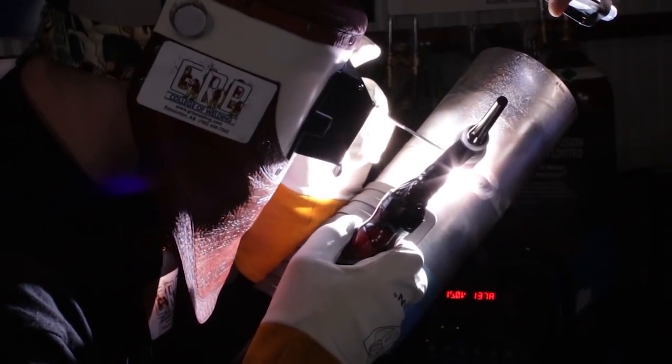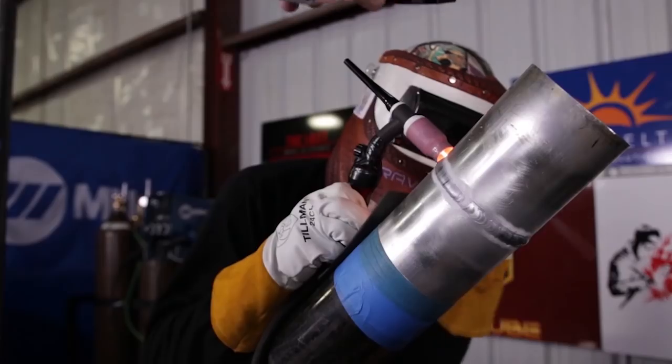Number 3 on the list is adding filler metal to the hottest point of the puddle. With the filler metal being fed externally on the outside of the pipe, the root pass is going in via capillary action. Where you add filler metal depends on the influence gravity will have. Normally on a 2G horizontal and 6G 45-degree angle weld, you add filler metal to the uppermost portion of the puddle so gravity pulls the deposited metal downwards. For a 5G position, it needs to be added to the middle of the gap for uniformity. On an extended land fit-up for horizontal and 6G 45-degree angle position, it is very easy for the internal root pass to go bell-shaped, with suckback and concavity on the uppermost portion of the root pass due to gravity acting on the weld puddle.